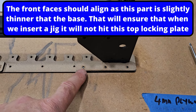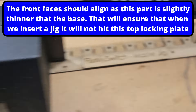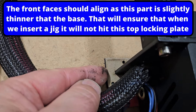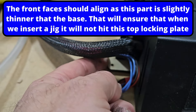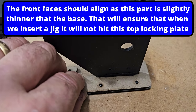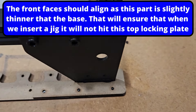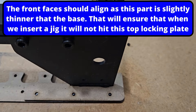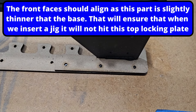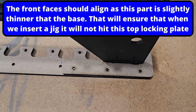I've put the glue on, lifted the laser, dropped the legs down — one hole on each side. Now make sure the top bracket is pushed into the right and the other bracket is pushed into the left. The brackets should near enough line up with the front face and the side, but that's not critical — what matters is getting a nice tight fit on the legs. Once you're happy, lift it up again and wipe off any glue, otherwise you'll glue your new jig to your spoil board. Put a little weight on there and give it 10–15 minutes for the glue to go off.